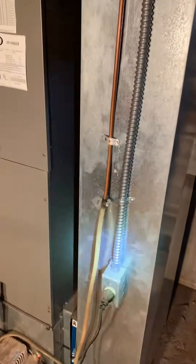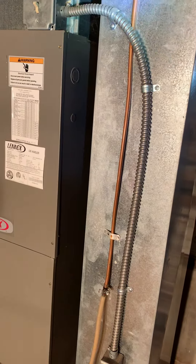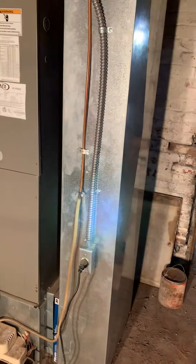We'll come over and down into the furnace. For the electrical, right now we're sitting at 220, so we'll get a different breaker and a 120-volt circuit. We'll probably combine these two into a switch-outlet combo.